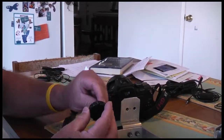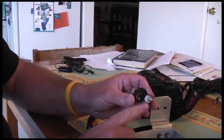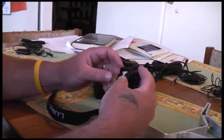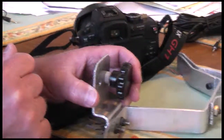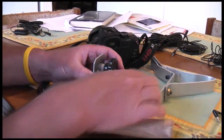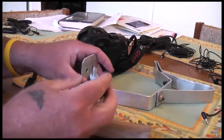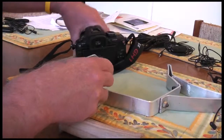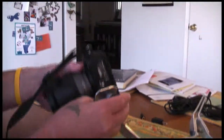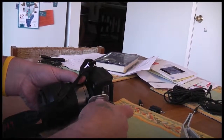Picked this up also in the hardware store. This knob is what allows us to mount it up. I bought this little nylon nut here, which I can use to screw on the other side here so that the knob won't get lost. It would really suck if we got to an air show and found that I'd been dragging this thing around and didn't have a way to attach the camera. So we have that little retaining nut, and it also works as a spacer so that the thread doesn't stick too far into the camera. You just thread this onto the bottom of the tripod mount. You have to make sure you get the same pitch and threads per inch of the little knob, and away you go.